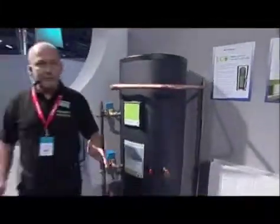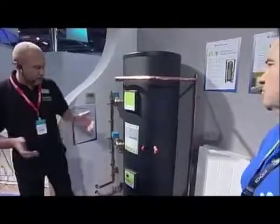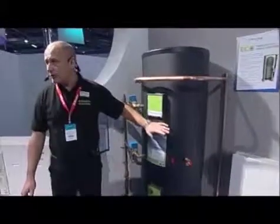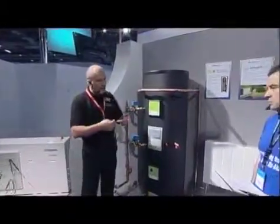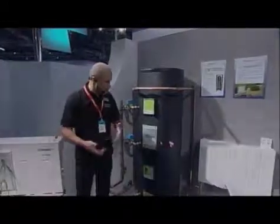This is a standard hot water cylinder. The cylinders themselves have to be specifically manufactured to match the heat pump. A standard hot water cylinder would only attain a value of around 35 degrees Celsius. This cylinder is a stainless steel product. It's got high levels of insulation to reduce the standing losses, and the actual physical coil size has to be bigger because we need to get the heat transfer inside the cylinder coil. The heat pump is susceptible to tripping out under a high pressure fault, and we have to ensure that the coil volume is matched to the volume of water in the cylinder.